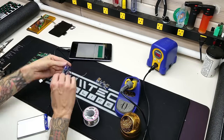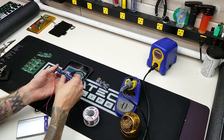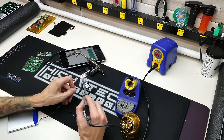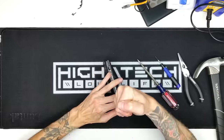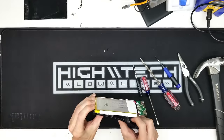Through my testing, these blue PCB charge circuits did not turn off when a load was applied. This will not work because the keyboard is a load and it is always connected to the charge circuit. That's why I would recommend buying the charge circuit separately that you know will turn off when a load is applied. There are ways of getting around that limitation by adding your own mechanical power switch.